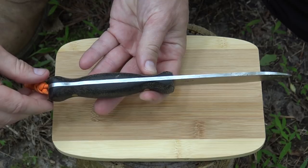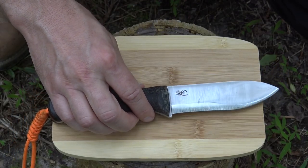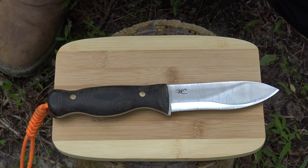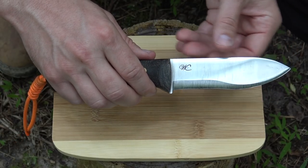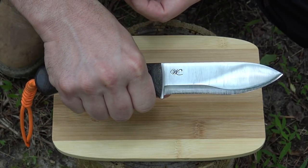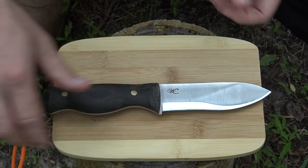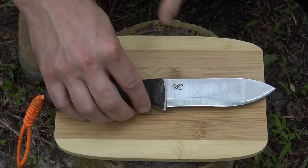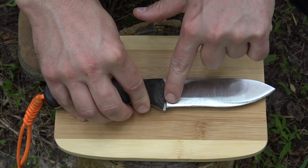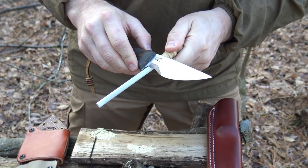The knife is made from 5/32 AEBL stock, so it is a stainless knife. One of the things I've found owning many of William's knives in AEBL is that it holds its edge just as long as O1 — and as William likes to say, he believes it gets sharper than the O1. The AEBL gets very razor sharp and holds its edge for a long time, and unlike many stainless steels it's just as easy to hone as O1 or 1095 with no problems. Some people may be intimidated by the multi-grind, but the angle is the same from base to tip, so sharpening is straightforward.